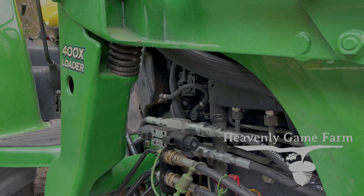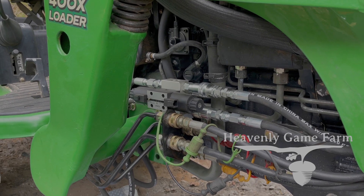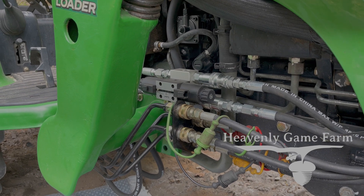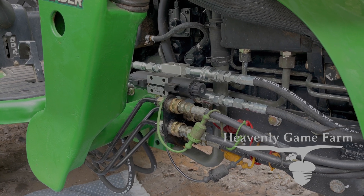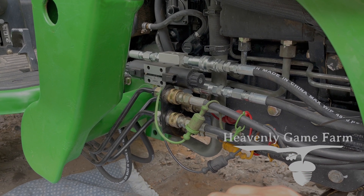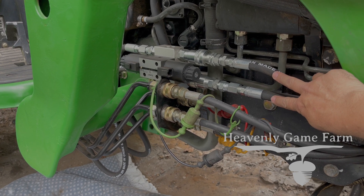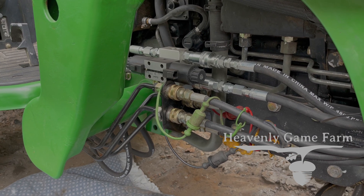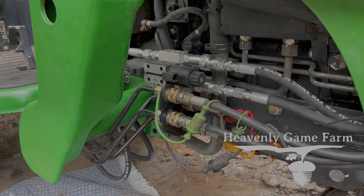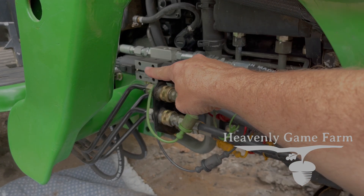Here's another look at the hydraulic valve third function I've been installing. I'm laying flat on my back underneath the tractor. What you're looking at is the control valve for the loader. The four black metal lines you see here are the four lines that power the loader hydraulics — the standard up and down and curl the bucket. Then these two ports on the right-hand side, one with a plug and one without, are what's referred to as the power beyond — and that's where the new third function valve gets its hydraulics. This is the control solenoid with the two electrical connections I'll be hooking up shortly.